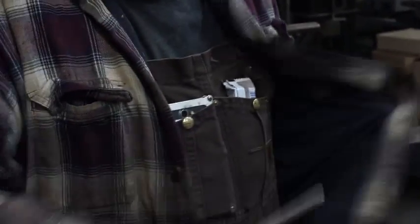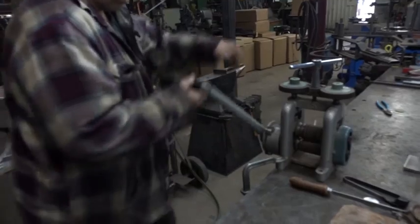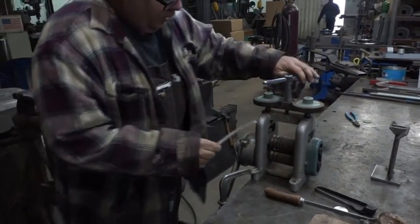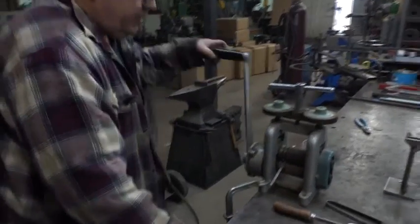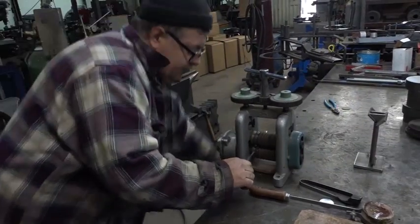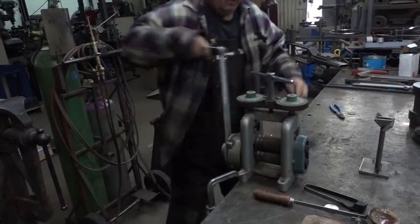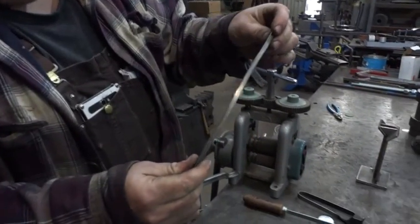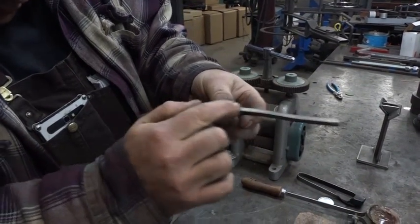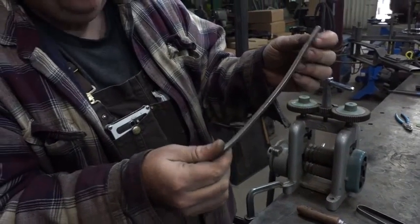So now we have an awesome piece of square wire. Don't put wet wire in your rolling mill because it'll rust — tighten down a little bit and roll it through. For the stuff I'm making, we need big heavy stock, so I'm not going to take this down much more — I want a nice heavy bracelet. This is as far as I'm taking this one. The next video will show you how we make it into a patterned bracelet. There it is — looking really good, no cracks anywhere, really solid, no pits. It's a nice piece of metal. Thanks for watching.